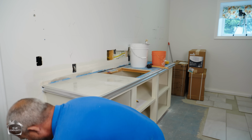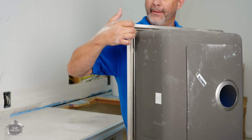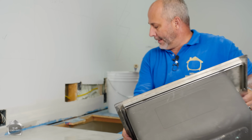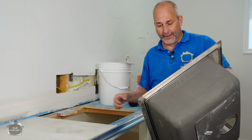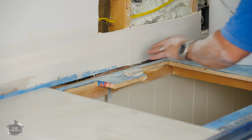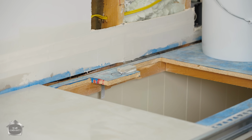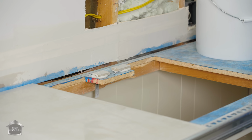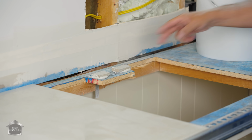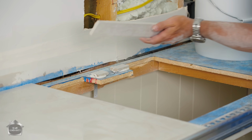As you can tell, a lot of sinks when they're surface mount, they have bracket lines like this. This has to be on the interior of the cut-in of the Formica so that you can put in the locking mechanisms. I am setting a little piece of stone on each side of where the faucet mount is with a big glob of cement, okay? And when I set the sink in, I'm gonna let that level that, okay? Same with the back. This is the piece that goes along the back of this counter.